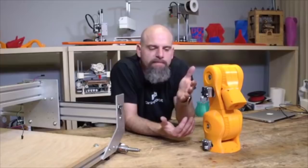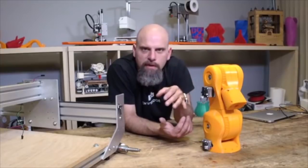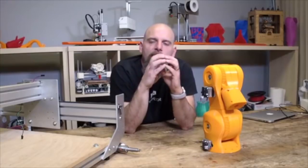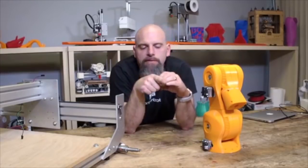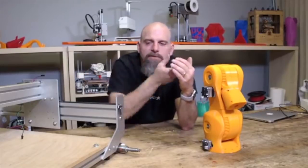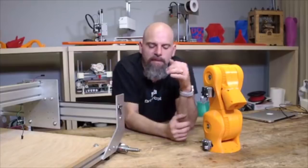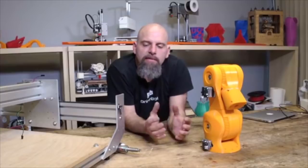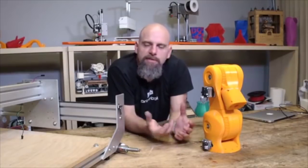Then he said, you know what, I'm going to take a break from this and try hypocycloidal gears. Hypocycloidal gears are really weird. You ought to Wikipedia that. Instead of sharp teeth on your gears, it's these oblong gears, and they roll across pins. It kind of scoots around this pin, and then it's already grabbing on the next one. By changing over to hypocycloidal gears, he was able to make almost zero backlash. I say almost because theoretically you can't have zero. But it was a very, very low backlash, 4 or 5-to-1 gear ratio. He thinks it might be enough to power this robot arm he's working on, and it was laser cut parts.